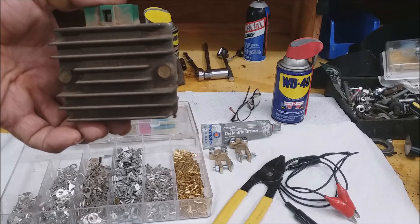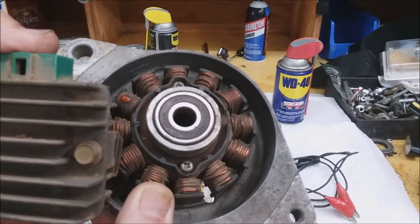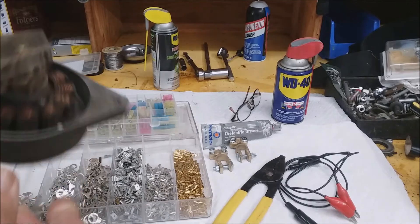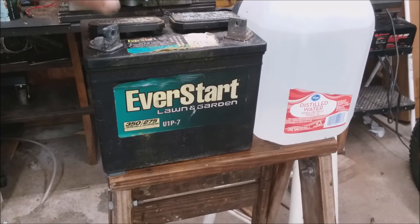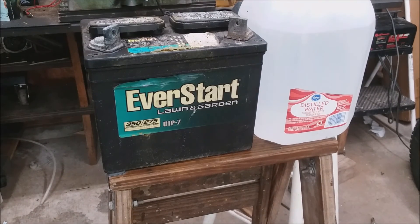Some tractors have a true alternator, which combines both functions — stator and voltage regulation — into one device. That's what's in your car. It's called an alternator because it alternates AC voltage, but the output is DC. That's what you'll find in most garden tractors. On smaller tractors, batteries often have two flat terminals — again positive and negative. You never want to connect the polarities in reverse. If you do that and you have an alternator, you can blow the diodes or damage the equipment. Red is positive and black is negative when using jumper cables.